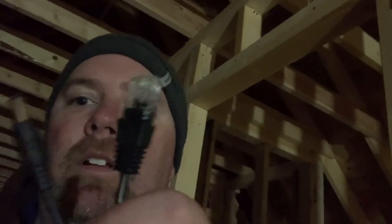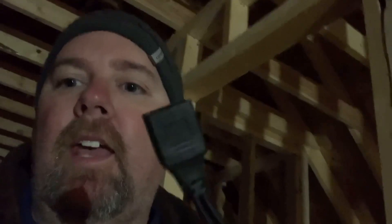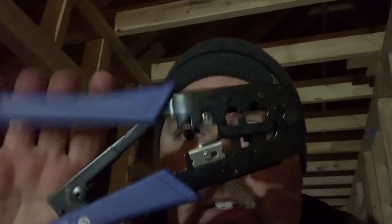So we're up in the attic. We've got to go over to the eave of the attic and grab that wire - that power wire from the camera. We've got to take our dongle and plug the camera into that end. We've got to cut a new fitting on the end - it's actually a Cat5 wire that we're making into an ethernet cable. To cut a new fitting, you're going to need some crimpers - these are four-pin and eight-pin crimpers - and an RJ45 eight-pin connector. I'll do a different video on how to do those.